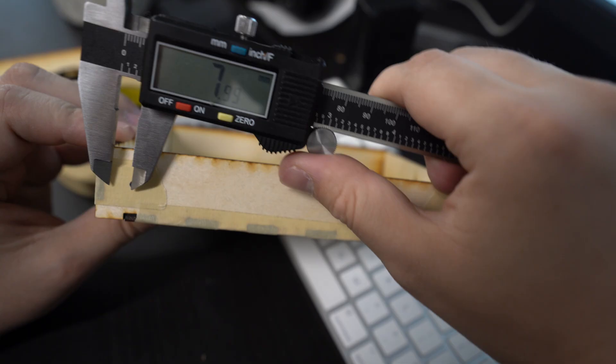So I brought the box home. The box design itself is literally just a generated box — I didn't actually design anything, I just plugged my numbers in and it spat out a generic box. So now I have to go through and place my components in the case, decide where they're going to go, and then make custom cutouts for the phase wires, the positive and negative terminal of our ESC, and cut notches for different cables like sensor cables. I'm going through with my caliper tool, measuring everything, figuring out where I want it to go, plugging it into the design, and then hopefully when we cut it out of a fresh piece of wood it'll have all the proper holes.